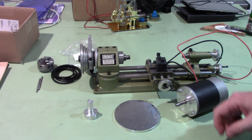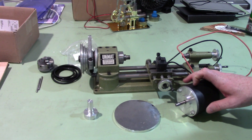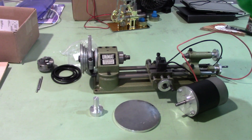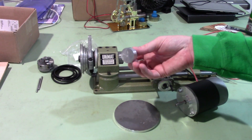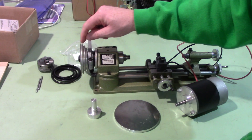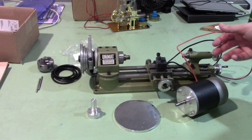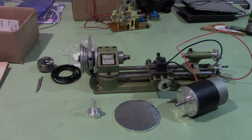I haven't really thought through the pulley yet. I'm also not sure about the motor — how powerful it is or how fast it spins or anything like that. So I think I'm just going to make a pulley, just make it this size, put it on there, put the power supply to the motor and spin it up and see what we get. Then I'll figure out exactly what I want to do as far as making the final pulley. I'll probably make it three levels so you can do different combinations of speeds. But with it being a variable speed motor and a DC motor, it probably doesn't really matter as long as I get something that's fast enough and has enough torque. So there's probably a sweet spot in there — we'll have to see if we can find that. But anyway, let's get started.